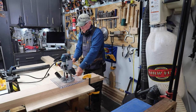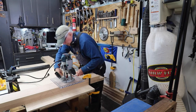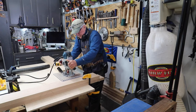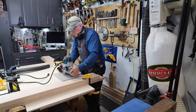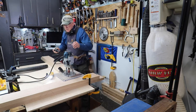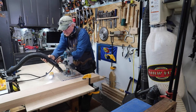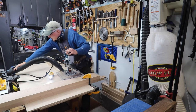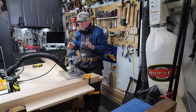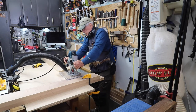So my last thing — I'm all supported, I've got the stop block, I'm ready to go. I just need to set my stop bar so I don't go beyond the line. I'll take my plunge router, release the stop, plunge it all the way down, and get a really good look at my depth. I've got the dust collection accessory on the router, so I can get the shop vac on there, nice and loose so it doesn't restrict movement. The thing I like about this router is there is no on/off switch — only a pressure switch. So I can't accidentally have it on when I plug it in.